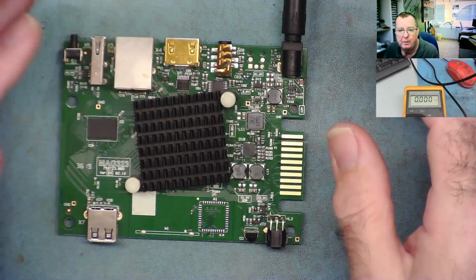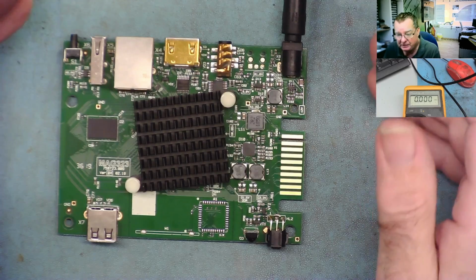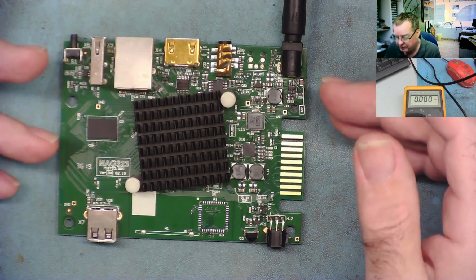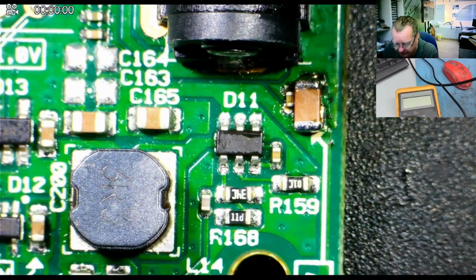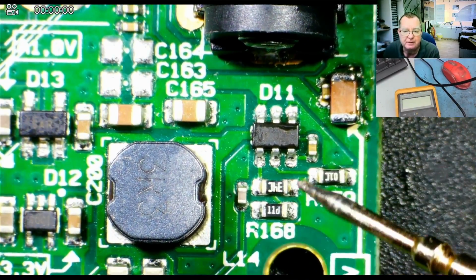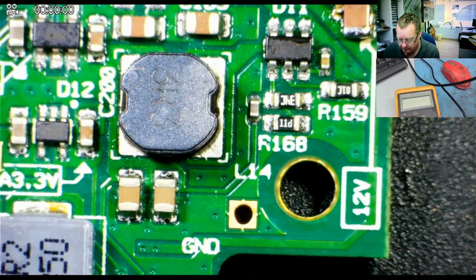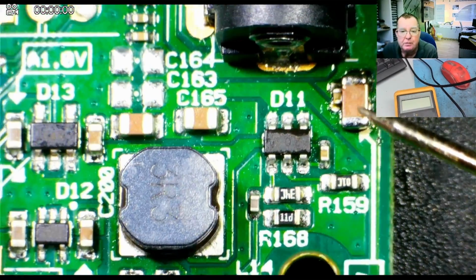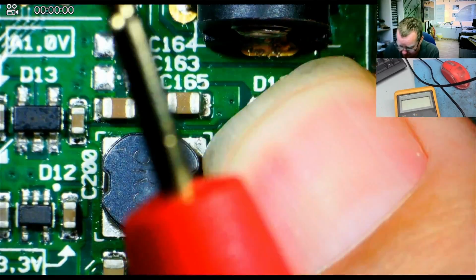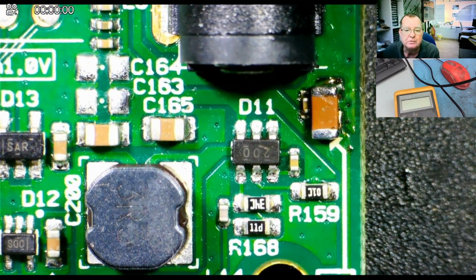I'll connect it up onto the TV, we can just see if it's working, but I'll just mention a few other things about these that you may come across if you're repairing these sort of things in Android boxes. It's very common if the wrong voltage power supply is being attached for this chip to fail, or one of these chips, okay. And if you look at it, it's just marked with 200. Just wiped off a little bit, you might see it a bit better. Yeah, you can probably see it now, the number is 200.